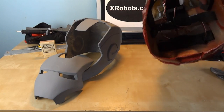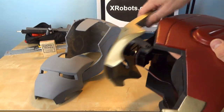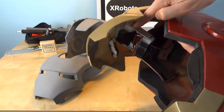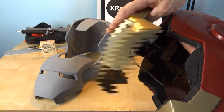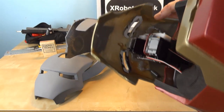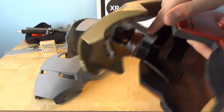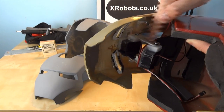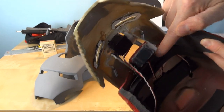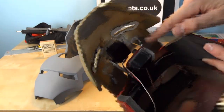So the original helmet was pretty crude. I made most of the pieces by hand. Basically it's two servos, one at the top and one at the bottom, and an aluminium link. Both of these can change angle independently, and they were just driven by a servo controller. There's a lot of hot glue in there, and all these pieces were made by hand out of an aluminium piece that was cut down with a hacksaw, holes drilled in it. There's some plastic blocks there to make up the distance to get this double hinged mechanism.